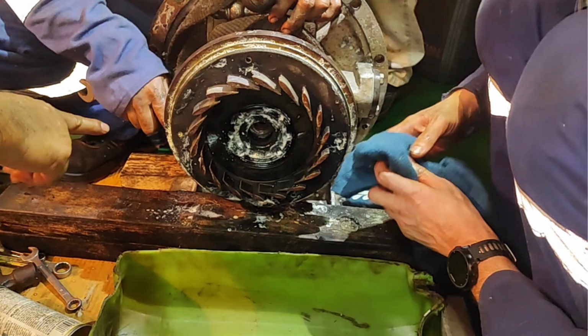Soak the nozzle into warm water to remove fouling. Avoid striking with a chisel and hammer. It will cause deformation of the nozzle blades, which is likely to induce surging and or reduction of performance. Dry sufficiently after washing and coat with rust-preventing oil for anti-rust treatment during the recovery period.